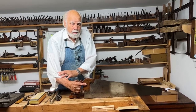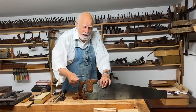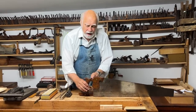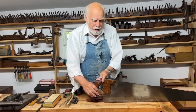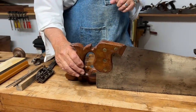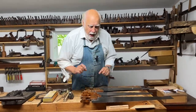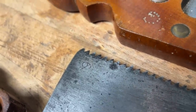You'll also notice that the saw handle is at a bit of an angle. That's because when you saw back and forth you're actually doing two things — sawing forward and also sawing downward. By tilting the handle, you equalize the pressure you're using with your arm, since your arm isn't a piston that just goes back and forth — it kind of rotates. The other cutouts in the handle are designed to make it as light as possible and provide places to hook on saw guards.